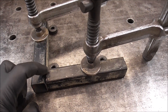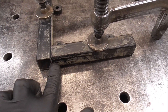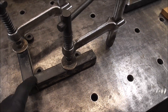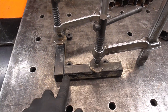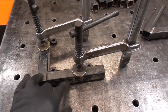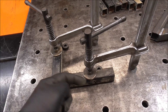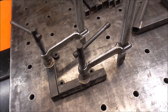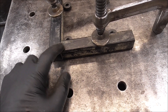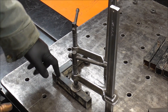It'll actually pull wherever you're welding - that's where it's going to pull. So you'd want to do a little tack here, then a tack here, then another one on the inside. The first tack pulls it one way, the second pulls it another, and the third pulls it the other way. Then you flip it over and weld the other side - that'll help pull the tension back. You're just trying to combat the forces of the weld.